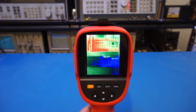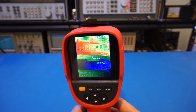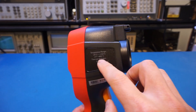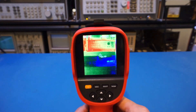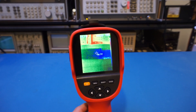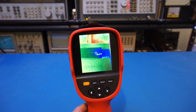There's also a balance between maximum temperature measurement range and thermal image quality. The ET692D can measure between -4°F and 662°F without having to switch ranges, unlike the UTi690B, but the downside is that the image will be noisier because of the wider range. This could be a pro or a con depending on the intended application.